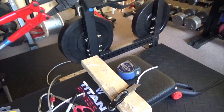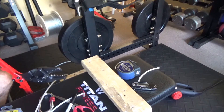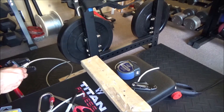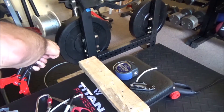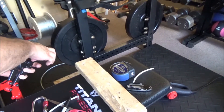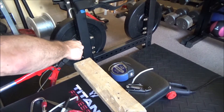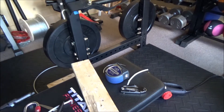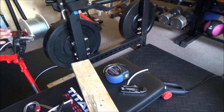I'm going to grab my swaging tool. This kind of works best when you can push it against something. You can adjust it, and it doesn't actually smush down on the cable until a certain point. I'm going to adjust it so my tool is on the little swage ferrule, make sure this is pushed through. So now once it's pushed through — time for the smushing. Once you've got the first swage in there, that thing is mostly good to go. Then I just make two more and away we go.